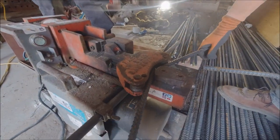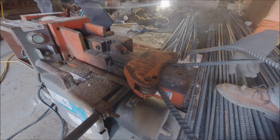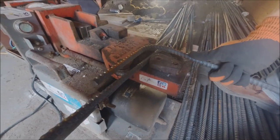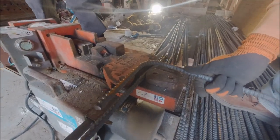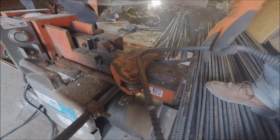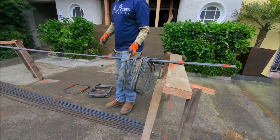After that little workout, it's time to get started with the rebar. We're using our Fast Cut 600 to make our stirrups — sometimes called squares. We're going to need about 80 to 90 of them; they're going to be installed on our rebar cages about 12 inches on center.